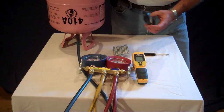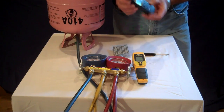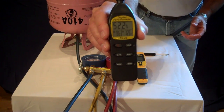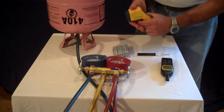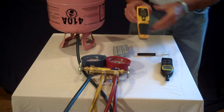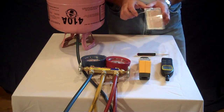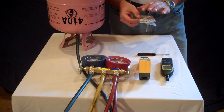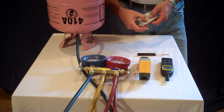The next step is to take the temperature. My tank has sat here for several days, so it is acclimated to the ambient temperature. I take my digital sling psychrometer and I have an ambient temperature of 86.3 degrees. The other method is taking my infrared thermometer and pointing that at the liquid inside the tank — I'm reading 83.6 degrees on my infrared. I look on my pressure temperature chart and look up 83 degrees for R410A, and I should have 245 PSIG.